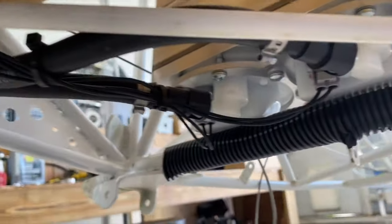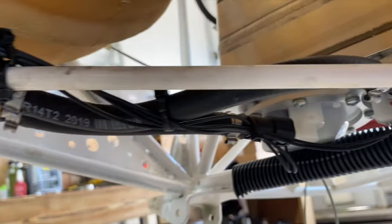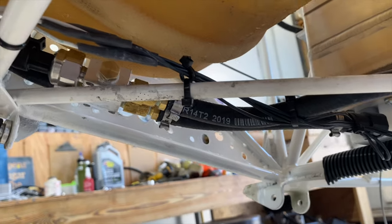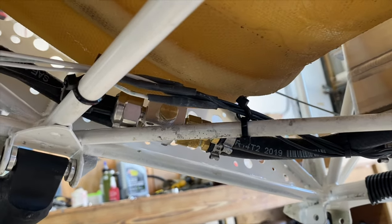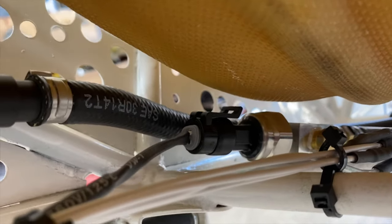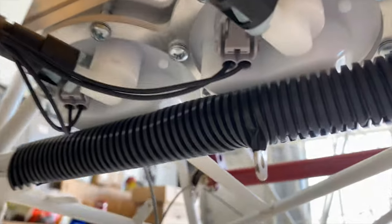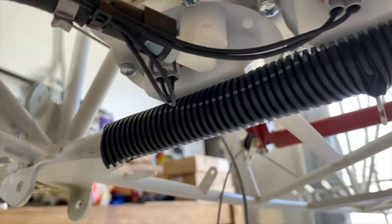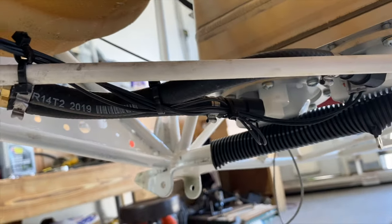There's a few wires here, there's two from each pump, and we've got some from the pressure transducer right here. So basically we got one cable that comes with the Viking View, and then we tee onto the prefabricated plugs that go on the fuel pumps. So you got four wires and a cable that runs back here.